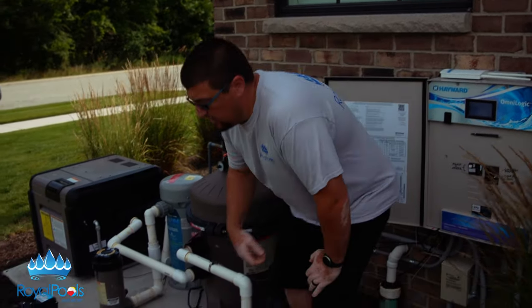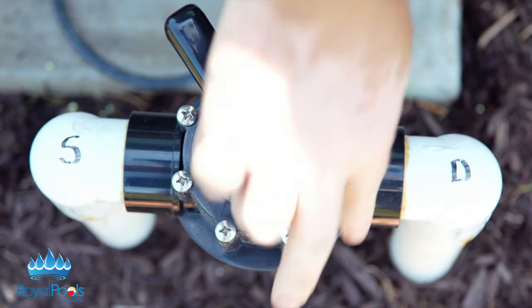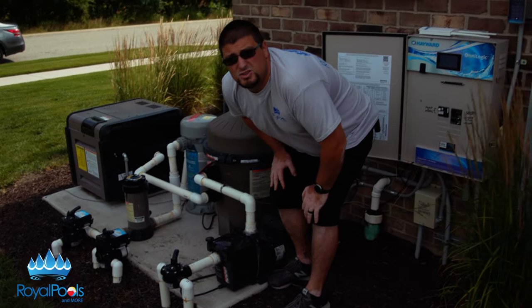The other thing we want to do here is take the valve and turn the drains down just a little bit. We're going to shut the drains down halfway, and the purpose is to increase the suction to the skimmer.